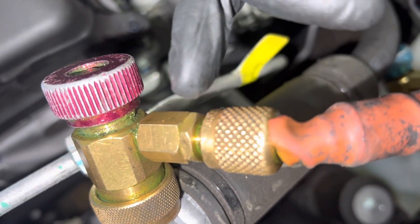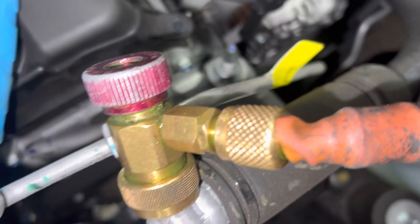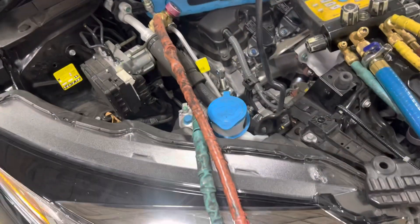Some manufacturers put these little sections here with adapters, and there's an o-ring right there that could leak. Take that apart, put some dielectric grease or Nylog in there, put it back on, and that'll stop the vacuum leak. I hope that answers your question.